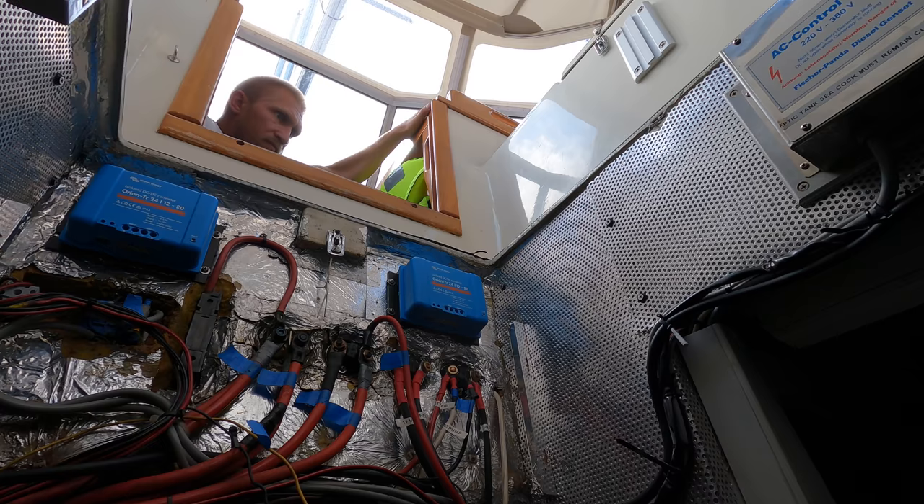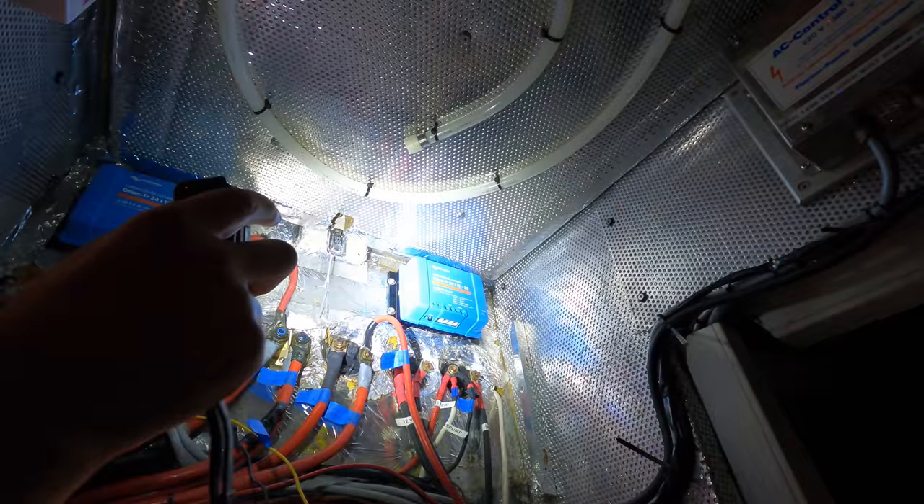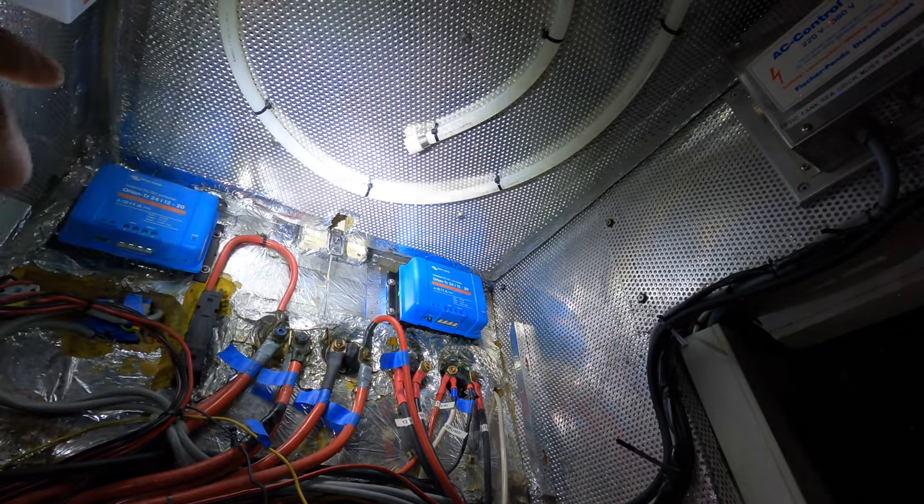Now I just really hope I can close the hatch. That seems to be okay — there's a good 15 to 20 millimeters of clearance above. Some of you might wonder if these converters are safe just beneath the hatch if there's a leak, but they are protected to IP44, so they're pretty well protected even if there's a small leak. And so far this hatch has been bone dry — there's never been a drop coming in even if you hose down the cockpit directly, so I'm not worried at all.